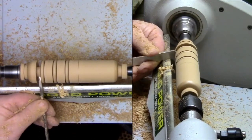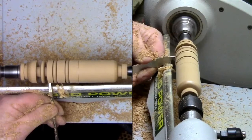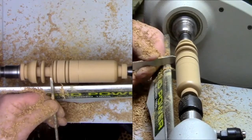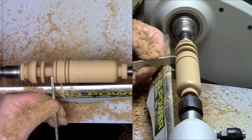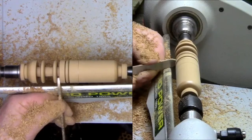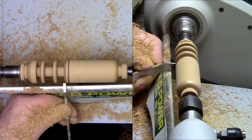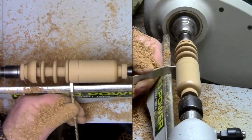So opening the cut up and going deeper than the depth of the ring, which is round to about 12mm, half an inch dowel, I'll open up each area between each bead so that we can then use the captive ring tool and release the beads. The areas between each bead are called dentils, which are like the turrets on a castle, and it gives us great access using the cat's claw or the bead forming tool to be able to release the beads.